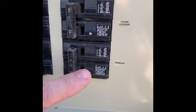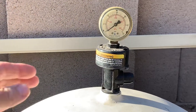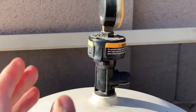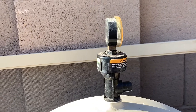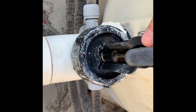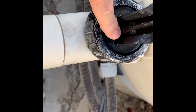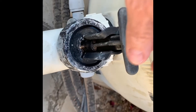Turn off the power to the filter — you don't want anything coming on. Hit the fuse panel or turn the timer off so it doesn't come on. Then make sure the pressure is released in the tank. You do that by rotating the pressure valve counterclockwise — it'll release the pressure. Then we've got to drain the tank as well, and the way we do that is by activating the valve. Turn it 90 degrees, and you'll know you got it right when you expose the pin.